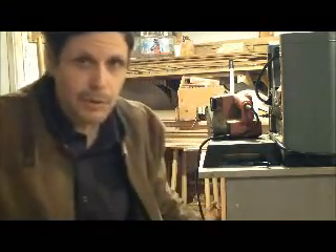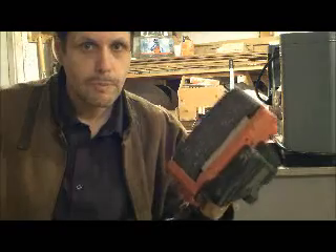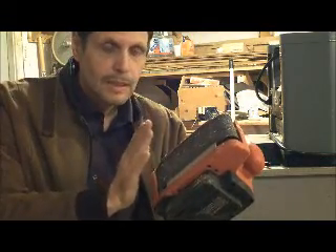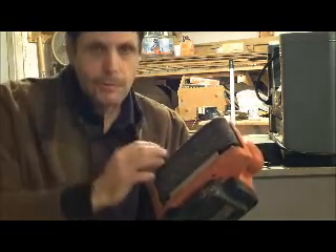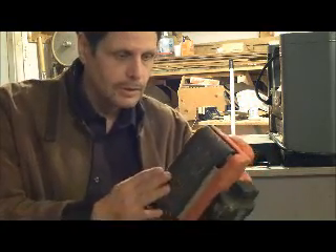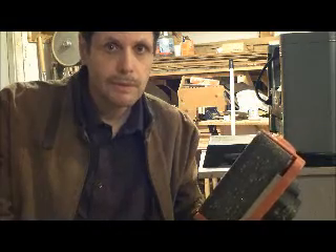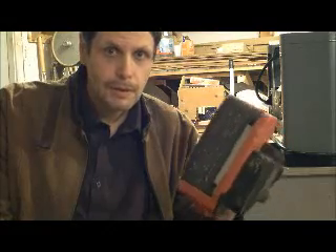Now if you really need to get material down and remove it very quickly, this is the one. This brute will rip the surface off very quickly if you put a 36 grit or a 40 grit paper on it. This is a belt sander and it's made for flat surfaces. It's able to remove material very quickly — it's brute force. You can use this and then finish up with the other sanders if you need to remove a lot of material. It will also make a nice flat surface; if you've got bumps and lumps, this will take them out.